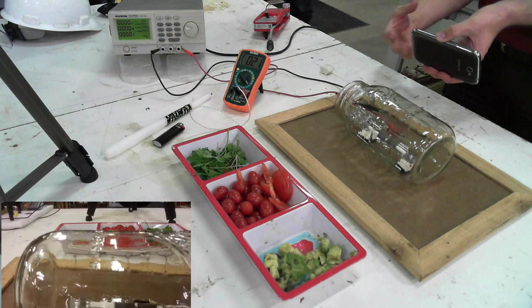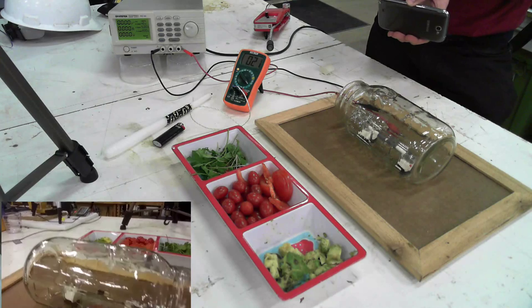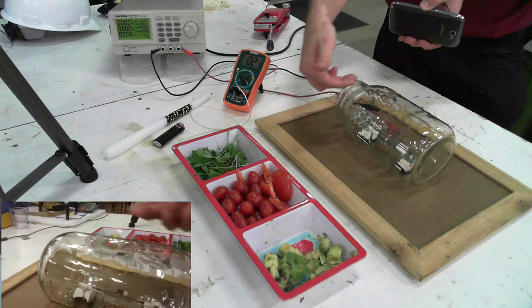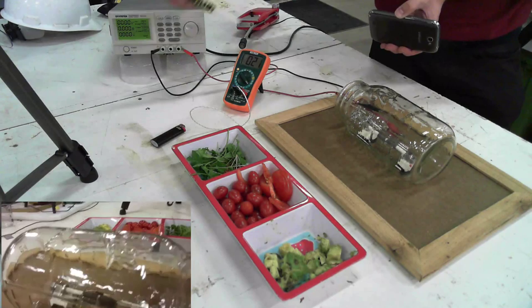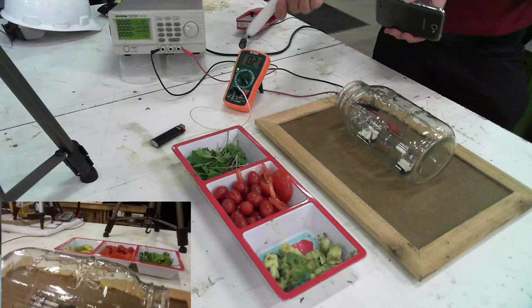And Parkhomov told us the other day that he uses a jar like this, with his little reactor in a bed of alumina in a metal tray suspended in there. And then the hydrogen, if it does leak, will come up to this sort of raised section here. And we have a combustible gas analyzer here, or detector. Detector, yep. That's right. Hopefully we can hear it. If that doesn't do anything, we'll do the Parkhomov test with the Batman tape repaired candle.